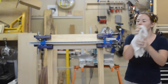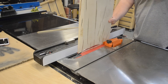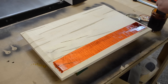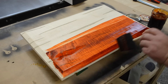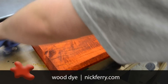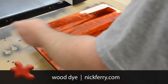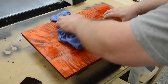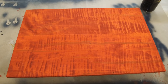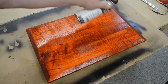We mocked up the table top off camera and it just looked a little bit thick or bulky, so I brought it to the table saw and put a chamfer on the bottom side of the table top. Being this was figured wood, I wanted to use a water-based dye to enhance the figure of the wood. Using a foam brush, I applied it to the surface liberally and then wiped off any excess. If you're interested in this dye, I'll have more information in the build article — link in the description below. The dye's not much to look at until you get a clear coat on it, so after about four or five coats of satin lacquer, this is what we were left with.